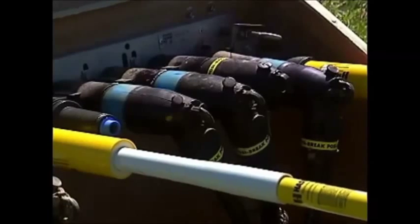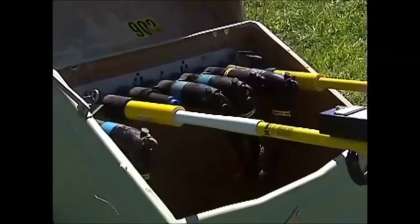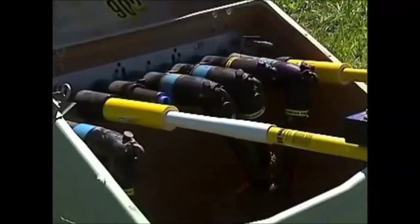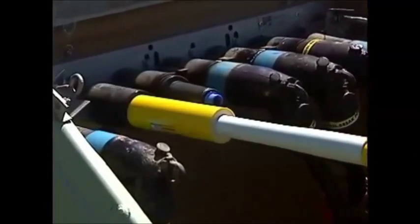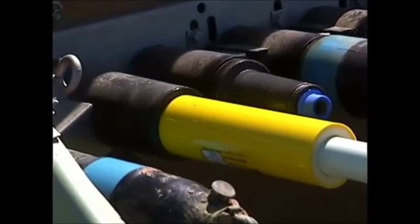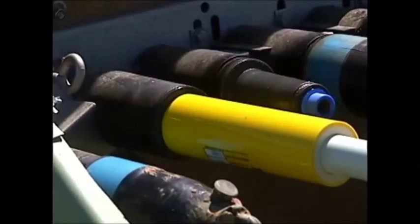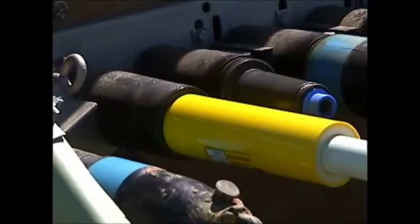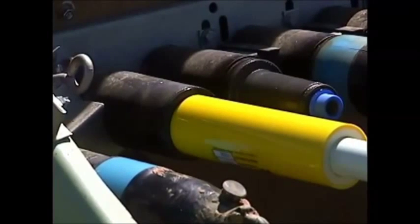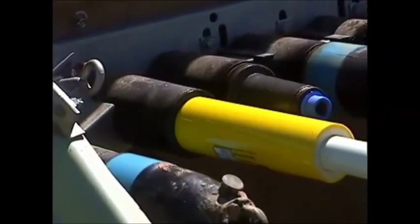In my experience, when there's a lot of moisture around the bushing of the transformer, I get an extremely high reading — is that normal? That's exactly right, that's normal. During extremely wet conditions, a lot of moisture in a cabinet, a good cable is still going to carry a higher reading — it's leakage around that bushing. That's part of the understanding of the DC high-pot adapter: a line-to-ground reading means fully faulted, a fluctuating reading means punctured cable, and a substantially high but stable reading means leakage current, whether from treed cable, bad splices, or high moisture. That shows up even more in a live-front situation where contaminated or wet bushings can produce almost a line-to-ground reading.